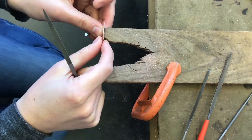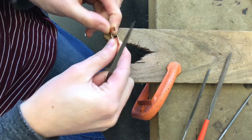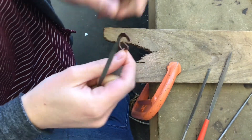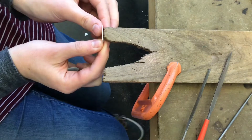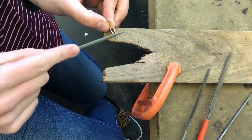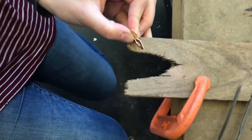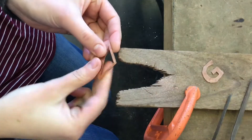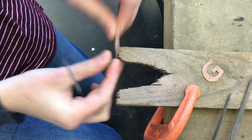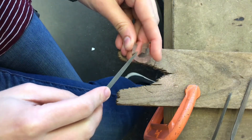I'm going to do this right up against the edge of my bench pin because my metal is decently thin — I don't want to bend it. With wood behind my metal to support it, it won't twist or bend. Otherwise, when you file you can just bend your whole piece, especially if it's small and thin like this. Having wood behind it really helps support it.